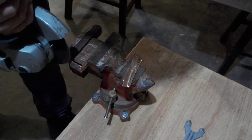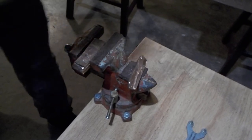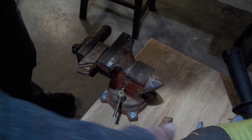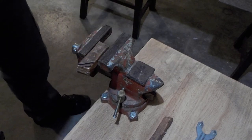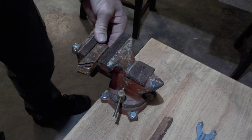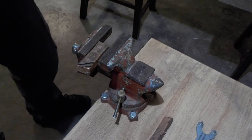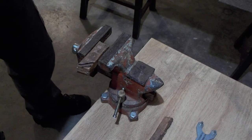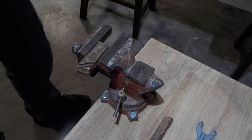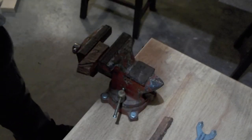Got a bit of a mark there. Okay, so with these old type of soldering irons, I've got at my off-grid place several different sizes, and all used for slightly different things. I've got a fairly specific purpose with this, so I'm going to try cutting it a little differently than the average run-of-the-mill and see if that works any better for me. So I'm going to make a cut down here, and then another one like that to give a knife-edge blade to the soldering surface.